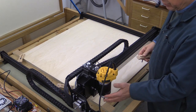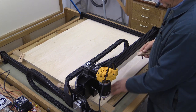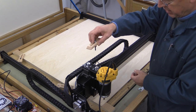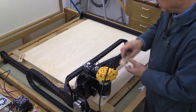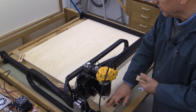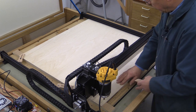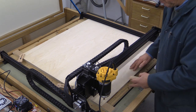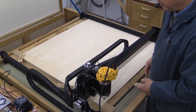I've put a 3/8-inch cutter in the DeWalt, which gives a clearance hole in the 6mm plywood so I can still use the fixing brackets screwed down into those screw inserts covering the whole main board. This blank board is sitting on top of some 18mm thick MDF just to protect the main board of the X-Carve, pushed up against the bottom rail so it's nice and square and positioned so I can get to my first cut with no problem.